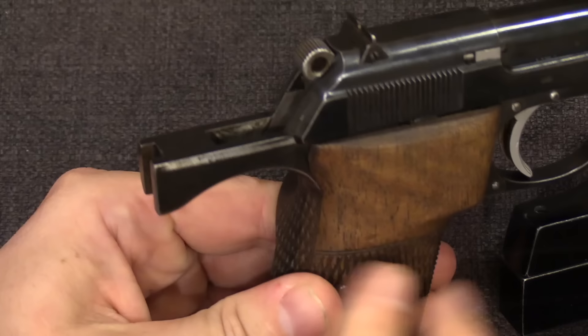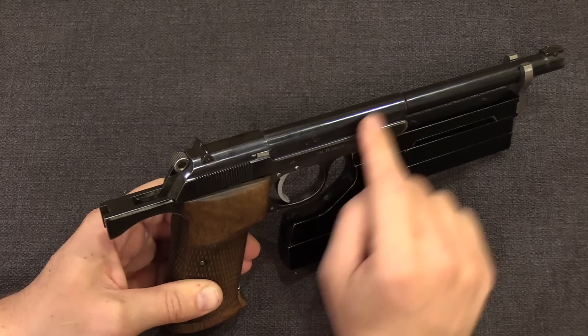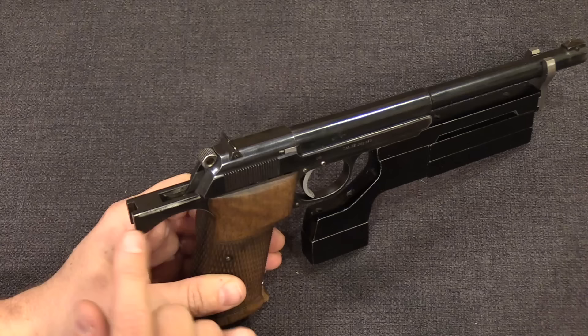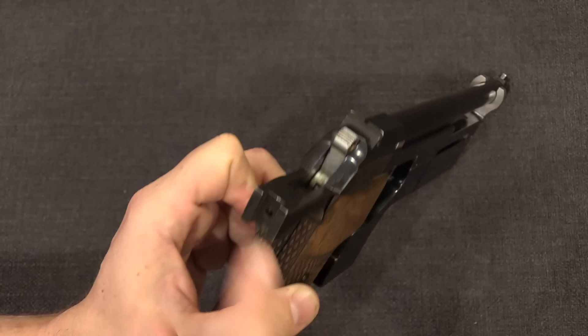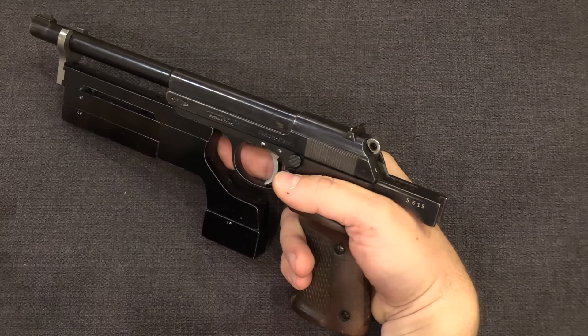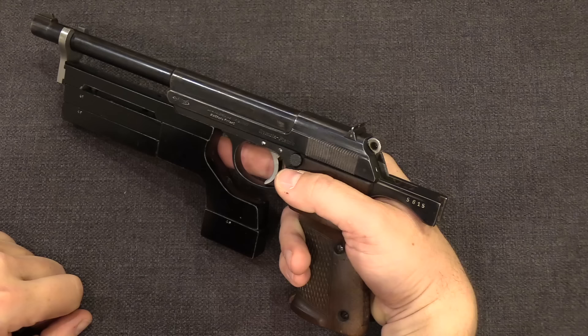They also added this extension off the back of the frame, there for a very specific purpose. The idea was to improve the sights. The front sight is fixed to the barrel, and the barrel is fixed to the frame — it doesn't move, only the slide moves. Having your rear sight on the slide introduces an element of variability. However, if you could put a fully adjustable rear sight fixed to the frame, there will be no movement between front and rear sight. These guns have a rear sight on the slide for casual use, and then there is a dovetail slot and threaded hole at the back so you can lock into place a much fancier rear sight — think of it like fully adjustable receiver tang sights on vintage single-shot rifles. Walther made about 160 guns with this frame extension and short slide.